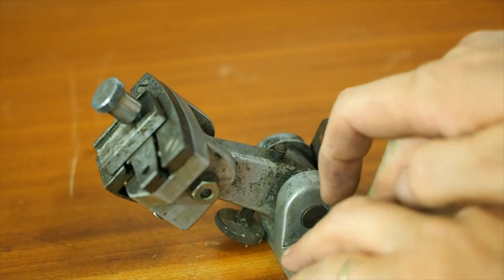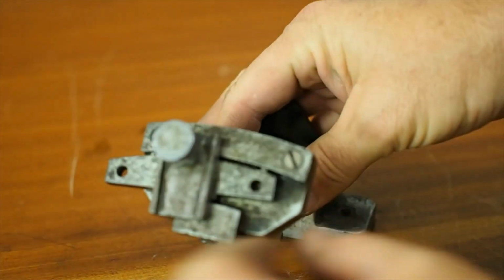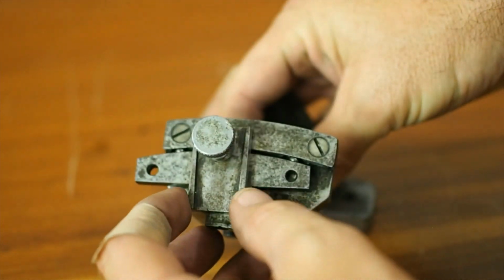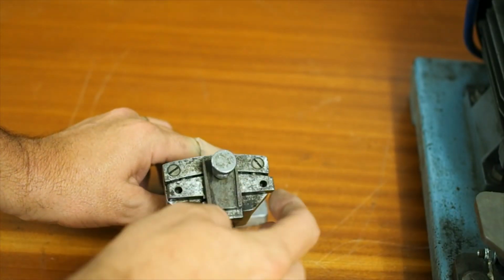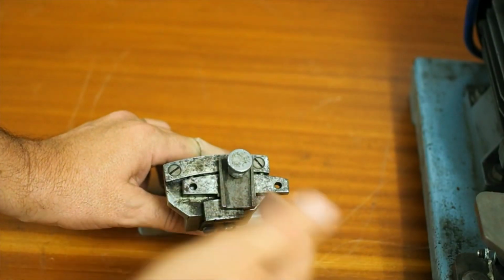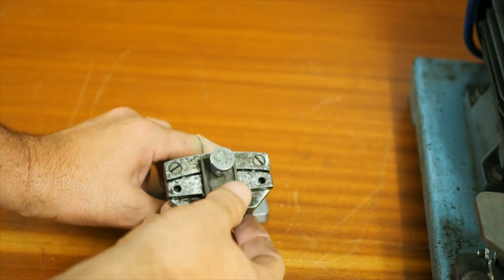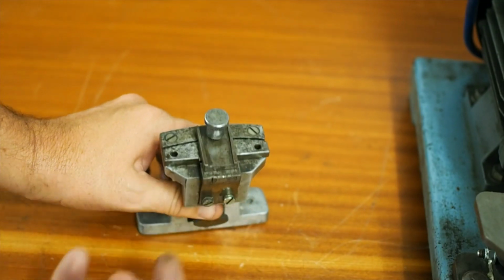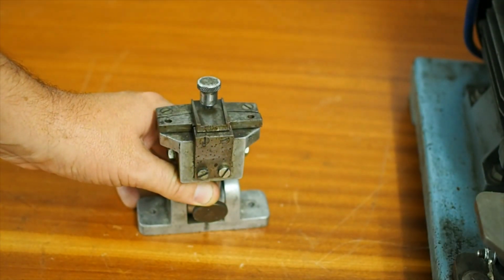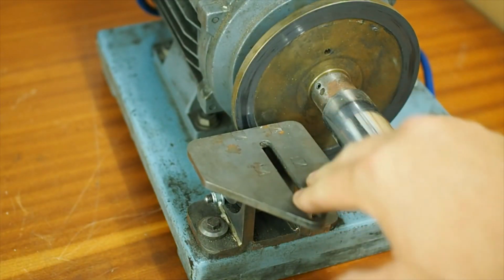This is the original Coburn grinding jig, which is both tilting and has this very cool sector bearing which to provide the rotation. Unfortunately, you'd have to replace these parts for every single change in radius that you need. And the minimum radius on this one is, I think, 150 millimeters, which is just too much for my hobby scraping use. So I put that in the box and just made up my own version. This swiveling tool rest I made out of a few lasered steel parts.